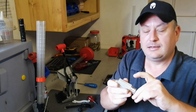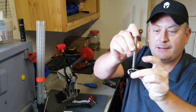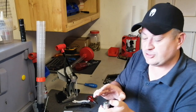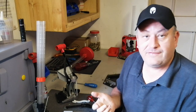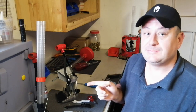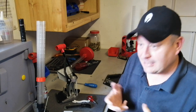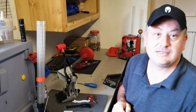This, with these claws, forces the case down onto the priming pin. There's not a lot of force needed to prime on this system - that's why it's so easy. You've got a primer pin being forced from the bottom and the case being forced from the top, making it very easy to prime. There's almost no feel to it, which can be a problem if you run out of primers. This presses so easy and so quick you're not going to notice it until you look at your cases and see they're not primed. So make sure your primer is topped up all the way.